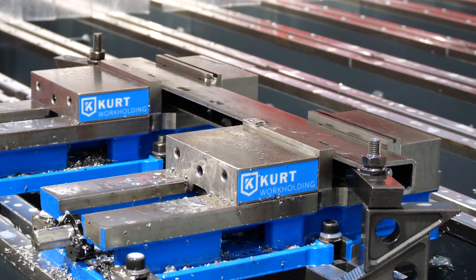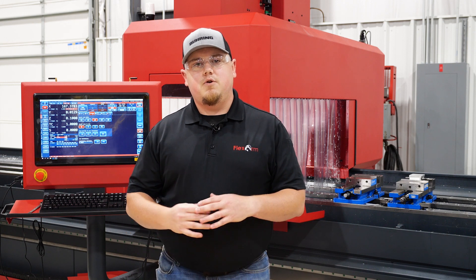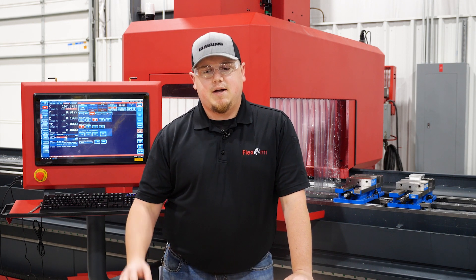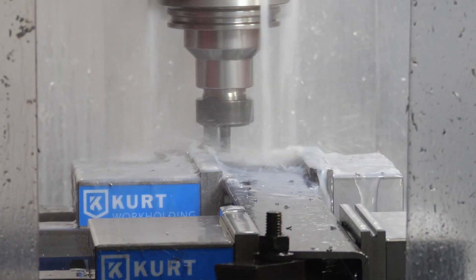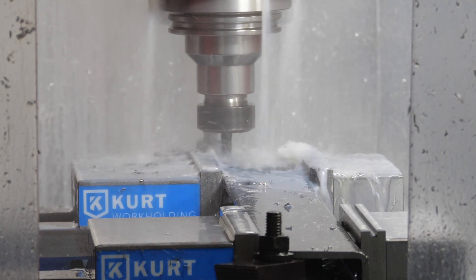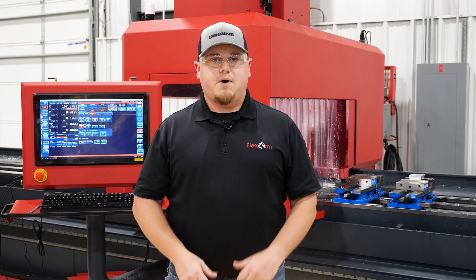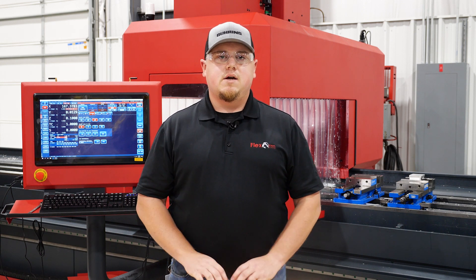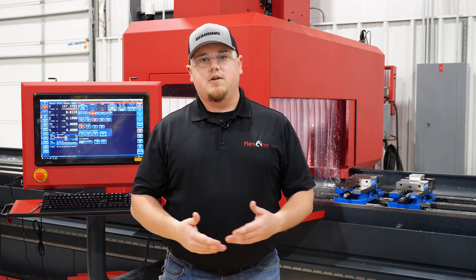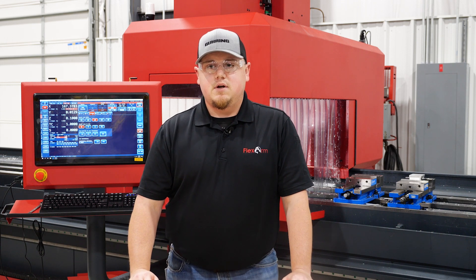So we ramped out some slots using a carbide end mill. In the video you're going to see a little bit of sparks flying here and there. As we were going down we were using a flat end mill, and sometimes when you're entering into the material with a flat end mill and ramping down, you're giving it that plunging action. Sometimes on structural material you can get some hard spots. We did have some sparks flying, and because of the size of the tool, getting coolant directly to the cutting flutes can be somewhat of a challenge, but the tool handled it just fine.